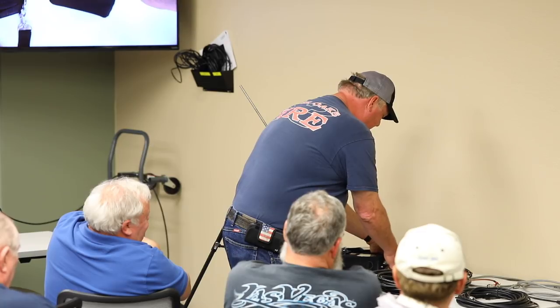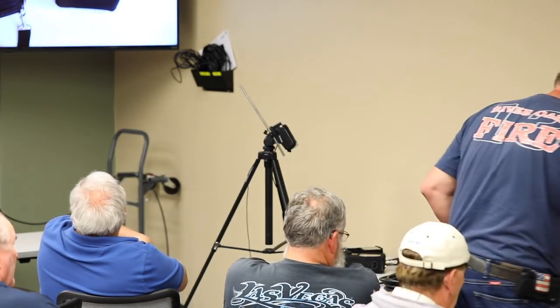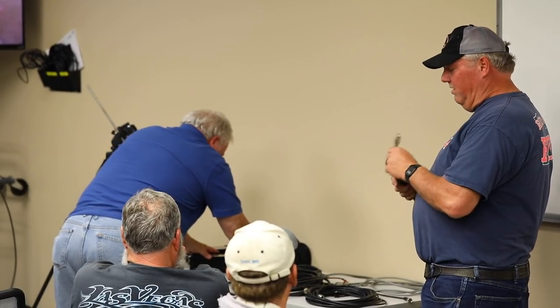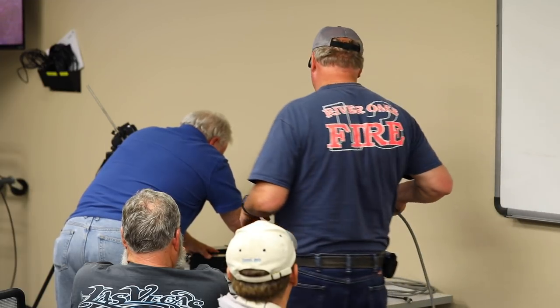So now we'll do one more, and then we'll be done, and then I'll hang around for a little bit. Anybody has questions? If I can answer them, I will. Depends on the insulation. It's foam. It's all over the map. You guys can look that up. Velocity factor is exactly what Brian just said. There's a chart. If you care to look it up, I'm not going to bring it, but it shows foam, polyethylene, and Teflon, all the stuff they use, right? And it tells you what approximate velocity factor a cable made with that insulation type material would have.